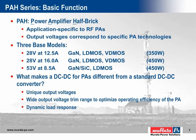Third, dynamic load response must be fast to respond to the high transient demands of these RF applications. Lastly, thermal management is paramount owing to the conduction-cooled enclosures in which these parts commonly reside. This requires not only high efficiency, but intensive thermal design to ensure that all waste heat is conducted efficaciously through the integral base plate.